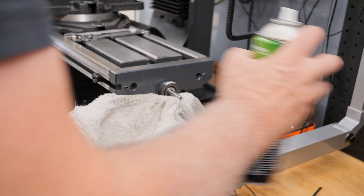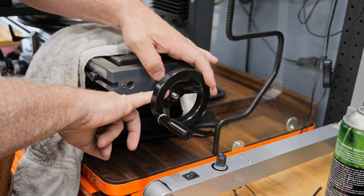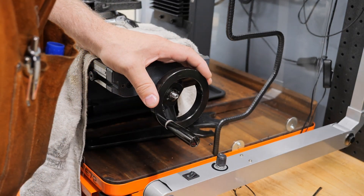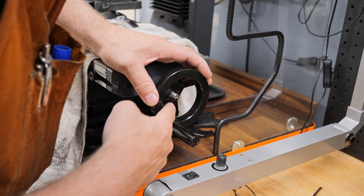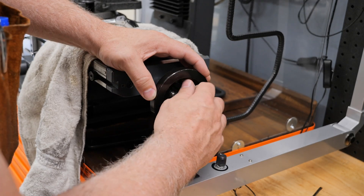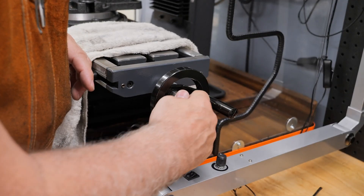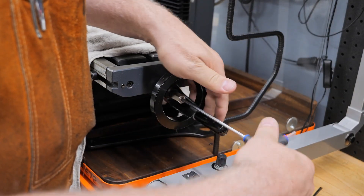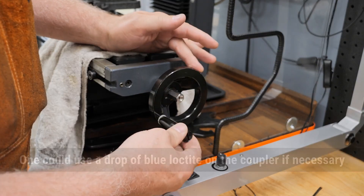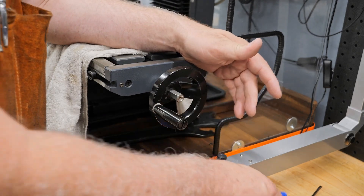After I take that handle off I'm going to clean up the thread — getting all the grease out of the threads. I'm going to put this back on. Now there's only about that much thread sticking out there, it's not much. I'm not going to use the washer that was on there — the thing I'm going to put on instead has a nice clean surface so it's not going to mar this in any way. The bit I'm going to use is an M8 stainless steel threaded rod connector. We'll put that on there just as tight as it was. And the next part of my little trick: a 10 millimeter M8 grub screw. I cleaned everything with wax and grease remover because I want it to grip. Get that nice and tight. Done. So that's my replacement for the nylock nut — an M8 threaded rod connector and an M8 10 millimeter grub screw, both stainless steel, screwed down nice and tight inside.